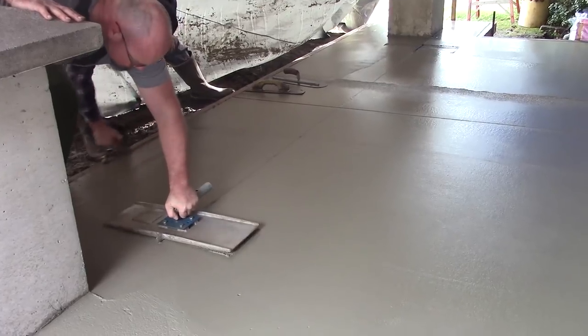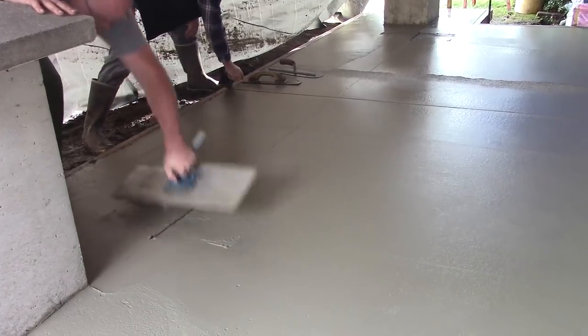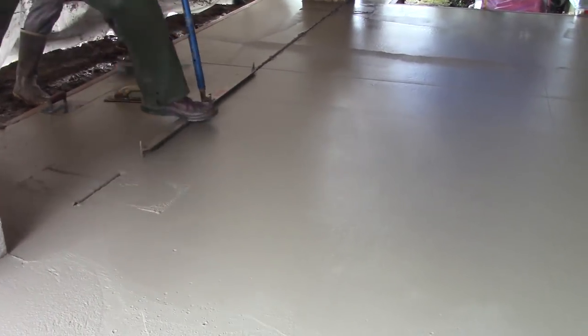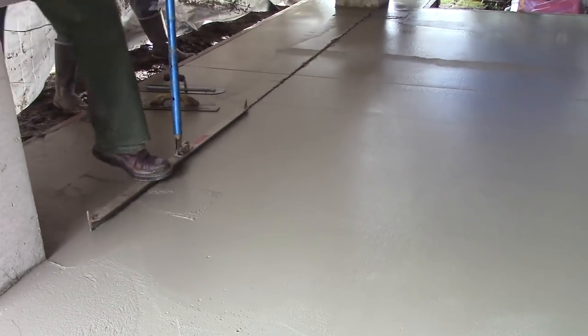You've got to understand when it's ready to strip and face, if you've got to pull off some vertical, expose some vertical faces. If you wait too long, it's too hard. If you do it too soon, it falls down.